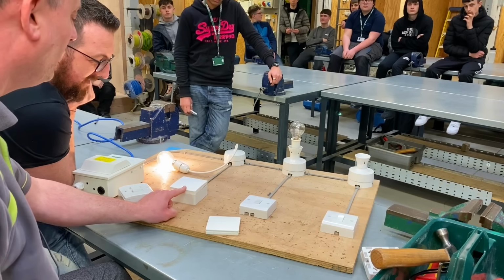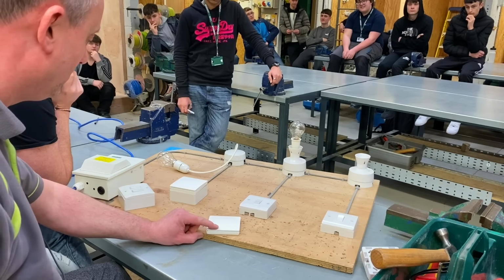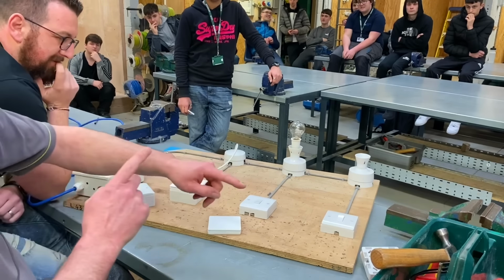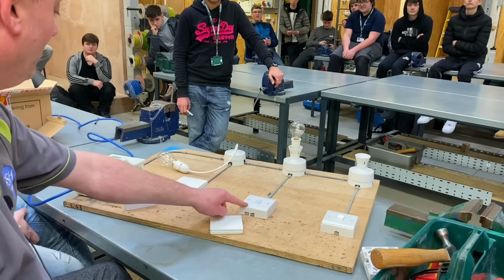It always seems longer than you think, doesn't it? So we're waiting, we're waiting, we're waiting. Okay, so if you press your switch now, and again, there you go. So if you do your one, I'll do that one off. Shut the front door. So we've got two-way switching. We've changed the conventional one-way switch.